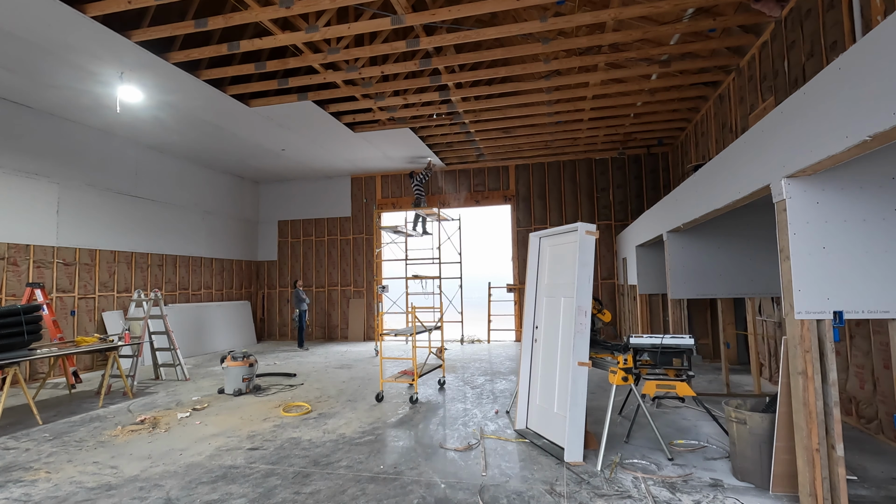And then I'll cut these down. Now those are a little big and they're sticking up a little bit, but I'll add some 45 material in here to chamfer that corner. That way you don't knock a tire down on it. That's the reason I'm being so particular with it, because versus me having to do all this measuring layout and then take my string lines down, pour these, and then have to come back and recalculate it all, I don't want to have to do that.